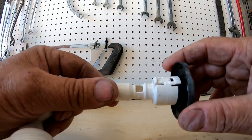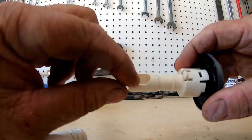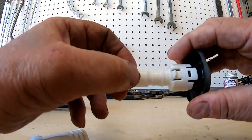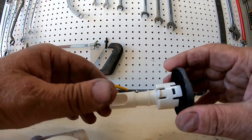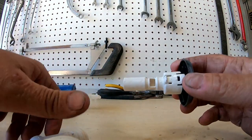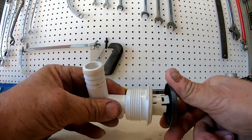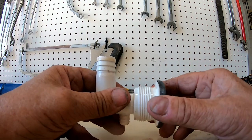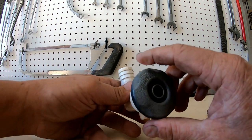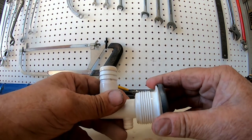If the clips are broken, you need to get new ones, or here's a quick fix: cut the little tab off, put a bead of silicone, push the jet in, let it set up overnight, and you just won't be able to turn it off or on. That's a cheap way to just fix a jet. I've cleaned it all out, got all the sand out. You gently push it in to where it goes, spin it to find where it actually seats, then turn it one way and the other — it's got a kind of speed bump. Keep going counterclockwise past the speed bump and the jet will come apart. Put it back together the same way.